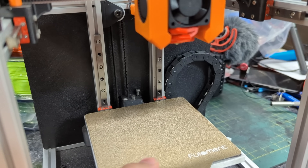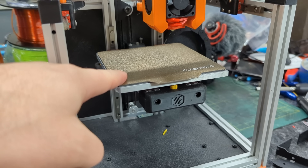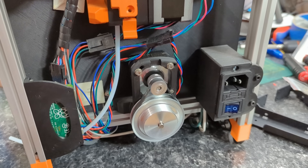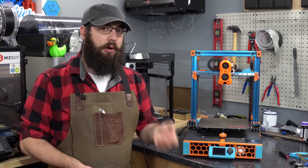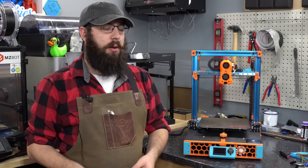You can get away with this using multiple methods. On a system such as a Voron V2, there is gearing in the Z drive modules, so that combined with the inherent torque of even a powered-off motor is enough to keep the gantry up, although you should expect a couple steps of drop on power off still. On a Voron V0 with the belted Z mod, the bed can be light enough that if you have a big enough motor, even when powered off, it shouldn't come crashing down, but there really isn't much holding it up.